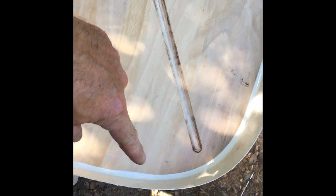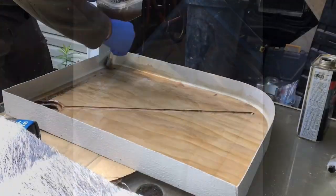Here's the final mold before I start putting fiberglass in. You can see the thin fiberglass shell I put around the sides and I routered this all out. I then siliconed all the corners so that it gives the fiberglass a radius to stick to, and there won't be air pockets behind it. All the corners have the silicone in them.